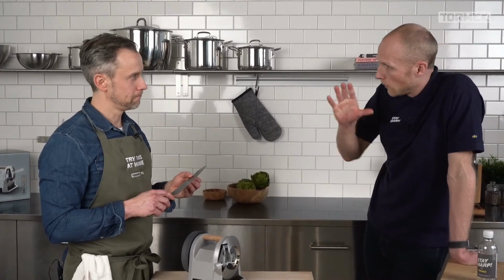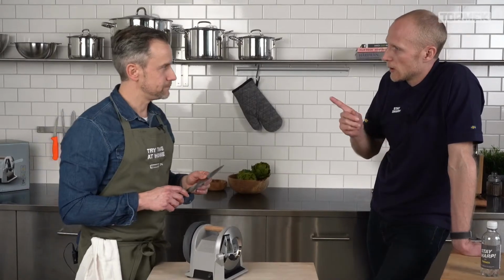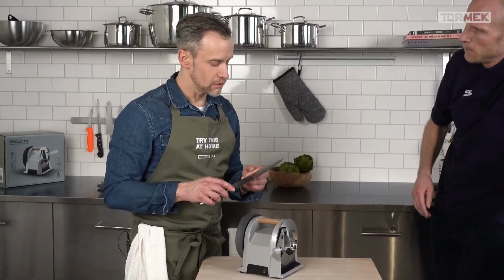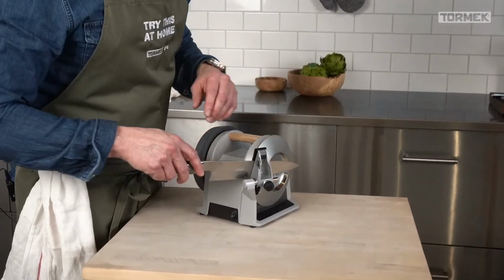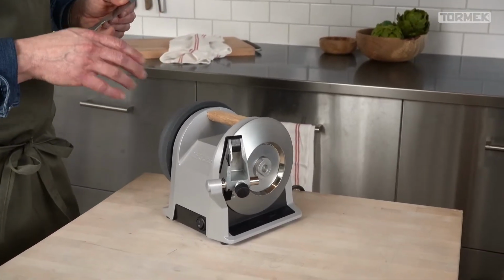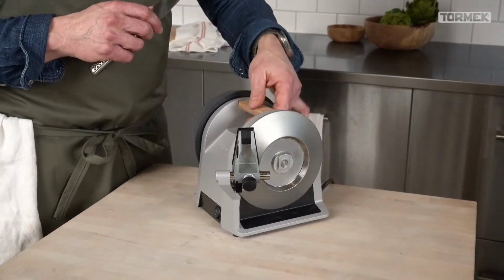And that's what we want to remove afterwards, right? Exactly, that's what happens on the honing side. The magic. One extra tip. When you're finished on both sides, you can add one extra turn on the opposite side from last. That gives us a little bit shorter time on the honing part. Great. Okay? Let's switch to the honing.